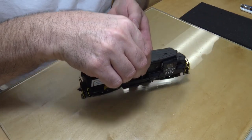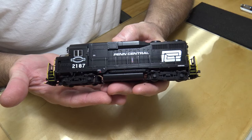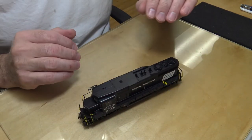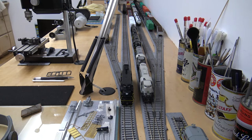She's all done. I forgot to put the wind deflectors on in the last segment, but those are on now so the locomotive is complete. I took the shell off and put in a 1k ohm resistor for the front and rear lights, and it brightened them up enough that when I look straight on I get that little starburst effect, which is what I was looking for. It's not as bright as the RS-11 but I like it and it works. Let's get this started up — I'll be quiet and you can hear everything.